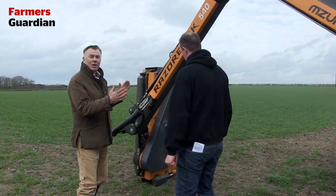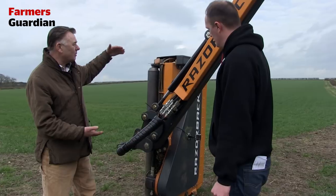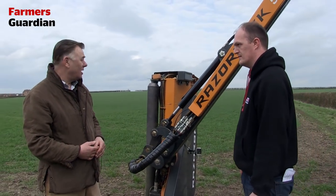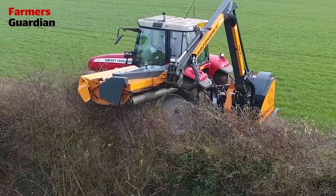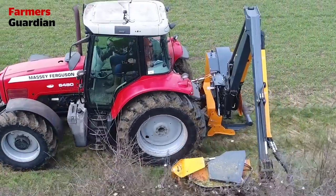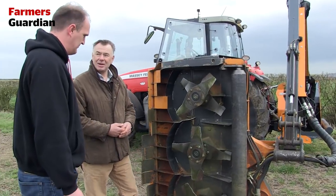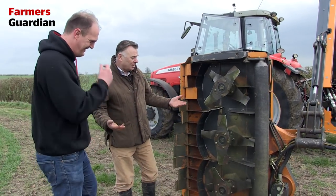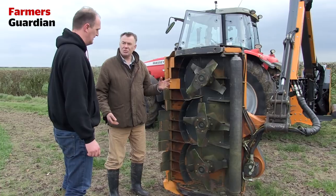This head is a narrow head, although it's five foot deep — there's not much dead weight to it, and it's very narrow, great between fences and edges. From a maintenance point of view, there's nothing to do. There are no grease nipples, there are sealed bearings. This machine's done a whole season and I've not put a grease gun to it — which is great because I tend to forget. Nothing can wrap to it. It is really simple.